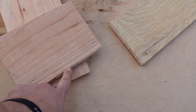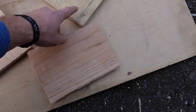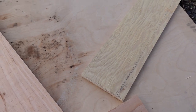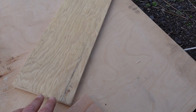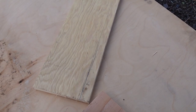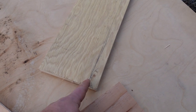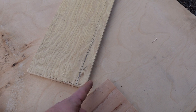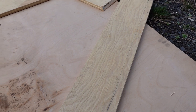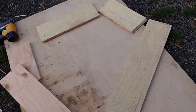I made a mark at five inches tall — that's where I'm going to nail the top of the chamfer strip, so that will be my grade mark. When I reuse it again to make the 195-pound stone and the 275-pound stone, I can set a mark at four inches and then set the chamfer strip at the top of the plywood to make those other sizes. So I'm going to nail this together real quick and then we'll start cutting the chamfer strip.